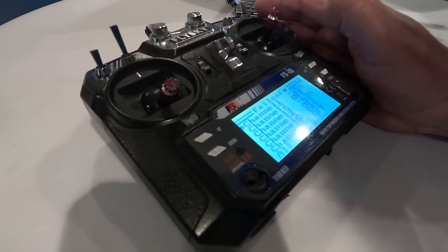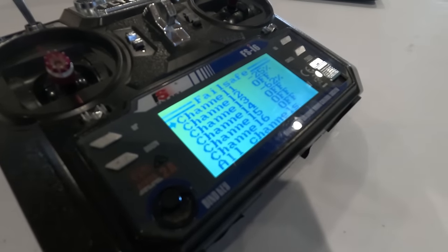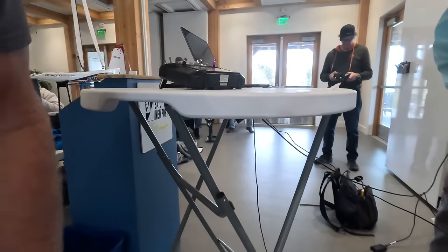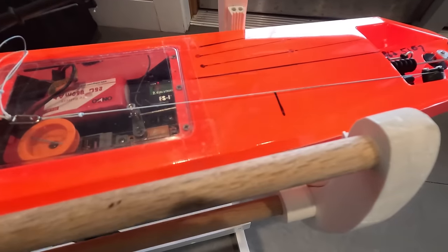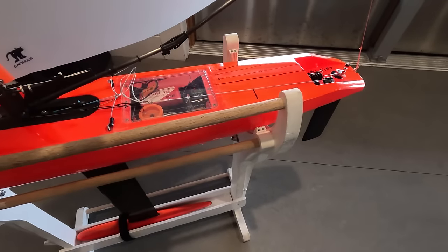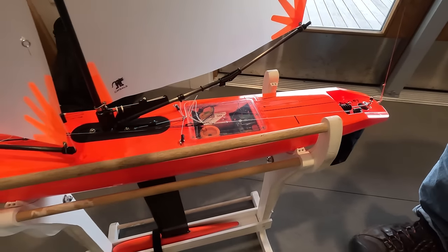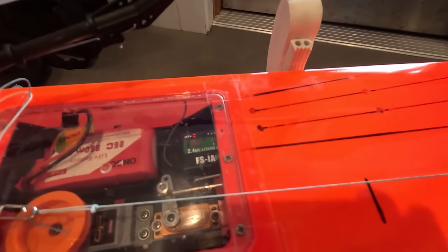Jeff, can you just talk about the marks that you have on your deck? Okay, yeah. So in addition to the sail trim marks that Brad developed, the one really important mark is to have a reference mark on your deck for your sheet position. Because inevitably, at some point you're going to break an elastic and your sheet's going to unspool, right? Or you're going to change your winch and have to replace it, or you're going to re-rig your boat and your sheets aren't going to be the same.